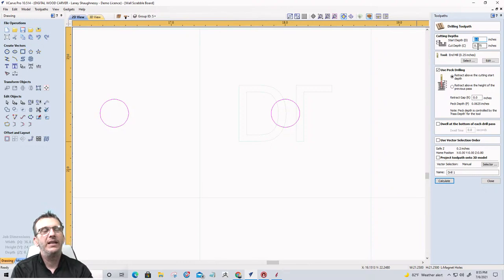But if I did, I wouldn't want to waste a whole lot of material. If it was plywood, I'd go with 1/2 inch because I don't need it to be very thick. If it's hardwood, I don't want to have to sit there and mill all my lumber down to 1/2 inch and waste all that material and everything. So I'd go with a 3/4 inch panel and all. That one I haven't really thought all the way through, but in this case, let's assume that we're going 3/4